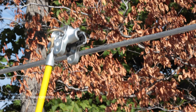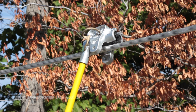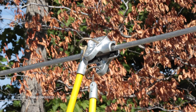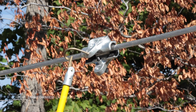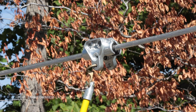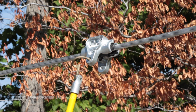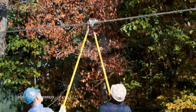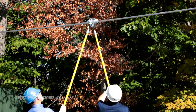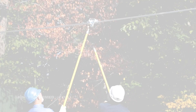Using pigtail or similar grabbing tools, lift the CGS upside down over the conductor using the working hole on the bottom of the body or one of the suspension mounting holes. Carefully position the housing so that the cushions are flush with the conductor and the bolts are parallel with the ground. Ensure that the CGS is located in its final suspension position on the conductor, as lateral movement of the suspension after beginning to tighten the bolts is not possible.